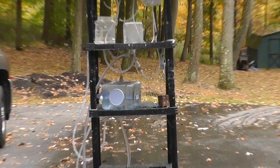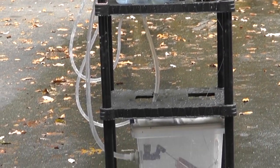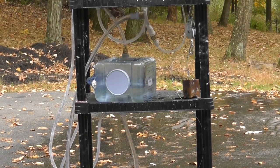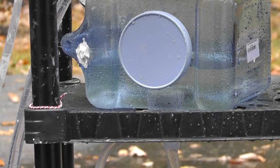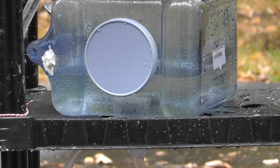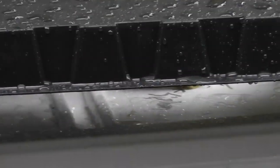Here's the fill level right there. Water. Slowly sucking it up. And as you can tell, this kind of slowed down too, because since there's a suction, even though there's a drop down into here, which is why I added this extra level here so I can have a bigger drop, even though there's that large drop pulling the water downward through the siphon, since you have that suction of the air pocket there, that's a negative pressure, and all that air in negative pressure is also reactionarily pulling up on the water, so slowing the flow into the spigot.